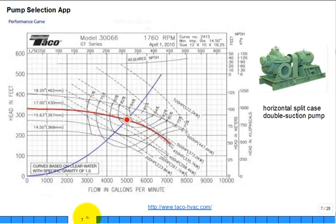So we have this system curve and we intersect it with the pump curve. And what's that point called? The operating point. When I put this pump with that red pump curve into the system, it will operate at that intersection point, the operating point. This will give me the flow rate, and this will give me the head gain across the pump, which is precisely the head loss in the rest of the network to get the flow back to the inlet of the pump.